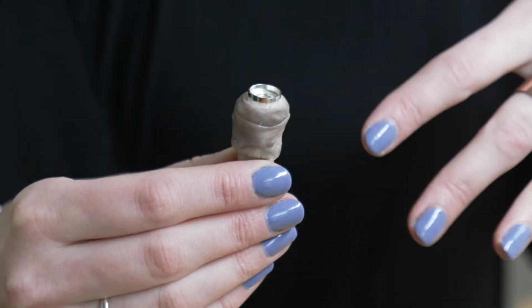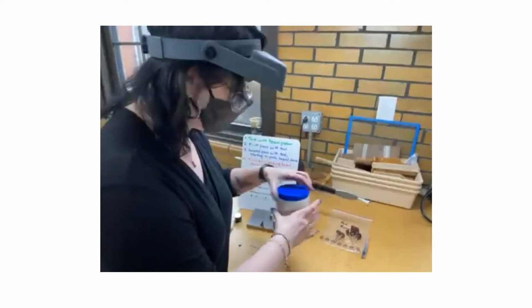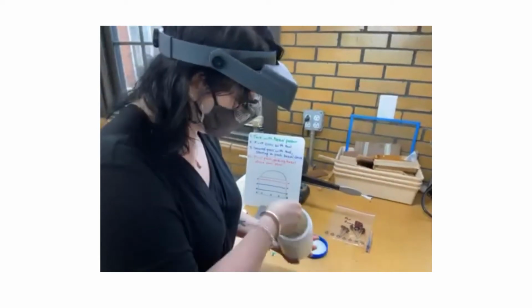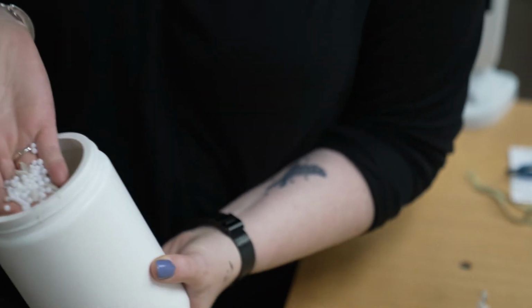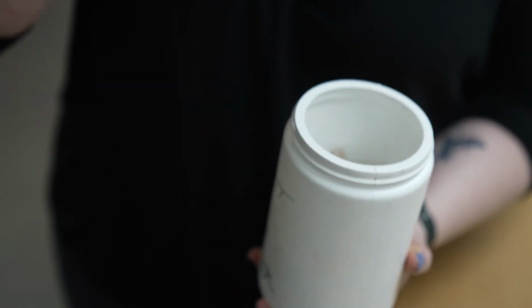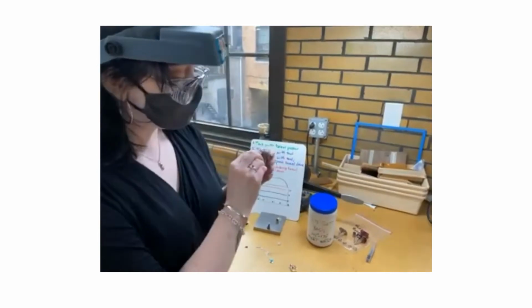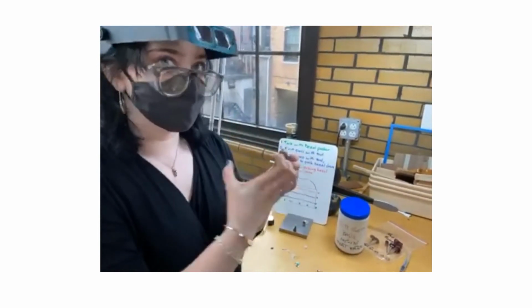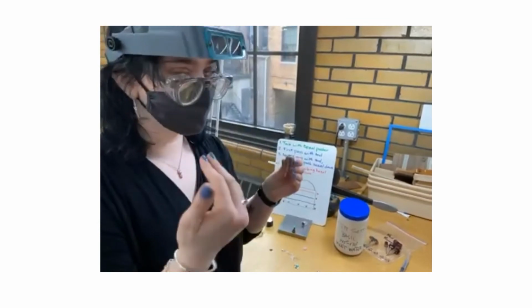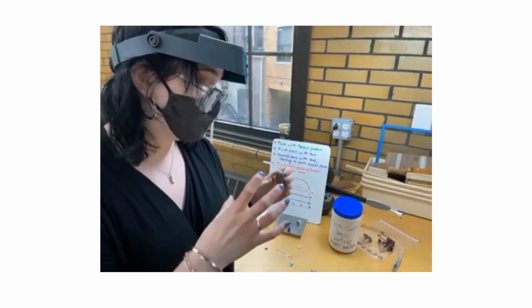And then, like I said, we have our setup here. I have my little bezel fixtured into jet set. We just use basic jet set here. It's just plastic, and it comes as these little beads. If you pour hot water on it, it becomes malleable. Then we're able to push it over our piece, and once it solidifies, we have a secure thing that we can put into the vise to actually do our setting. So it helps to protect our piece from the actual setting process.